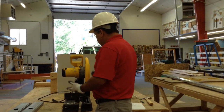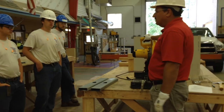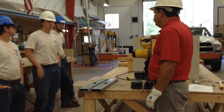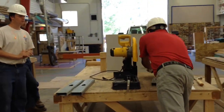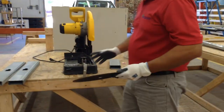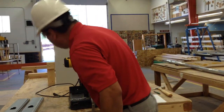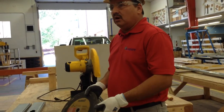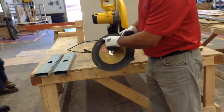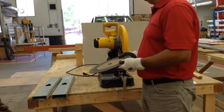Any other questions before we wrap it up? Do you have to change the blade every so often when it's damaged? Yes — the blade, like we talked about, visual inspection along with a field touch. I can tell even by looking: we made two cuts with this new blade and you can see there's no damage, it's still black — whereas the old one has been used for quite a bit of time and it's yellow. You can start to see the thread inside, which means it's torn and it could probably fail on you.